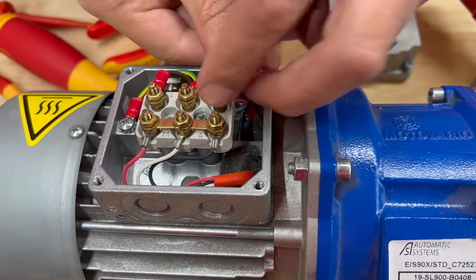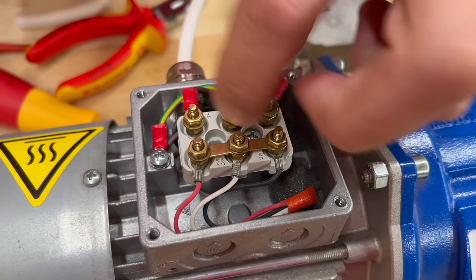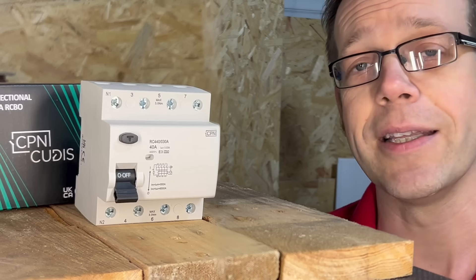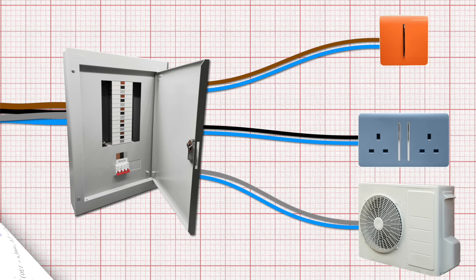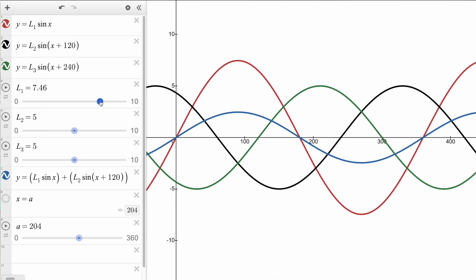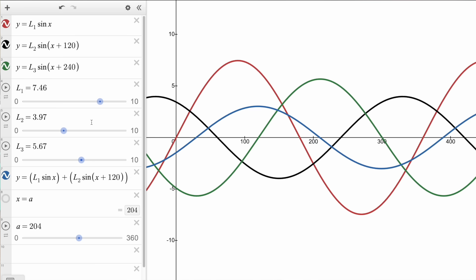Generally speaking, there are two ways that we use three-phase electricity. One is to supply loads that only require three phases to operate correctly, like motors and other contained pieces of equipment where the current in each phase is exactly the same. The other way is to take the three phases and break them down into their individual phases to supply single-phase circuits and loads via distribution boards. In this circumstance, the waveform starts to behave a little differently. What tends to happen in reality is that the three phases are almost impossible to perfectly balance, and one of the phases starts to carry more combined current than the other two. As this happens, you can see that the neutral current is now no longer at zero, but is starting to change as the imbalance in loads becomes larger.